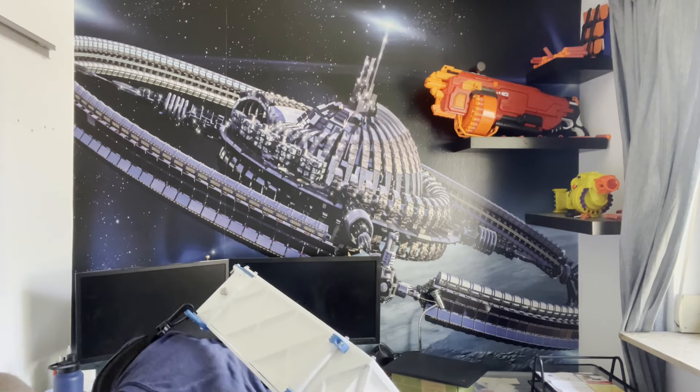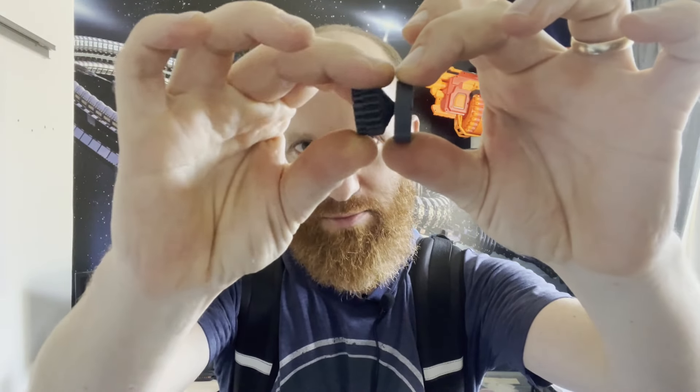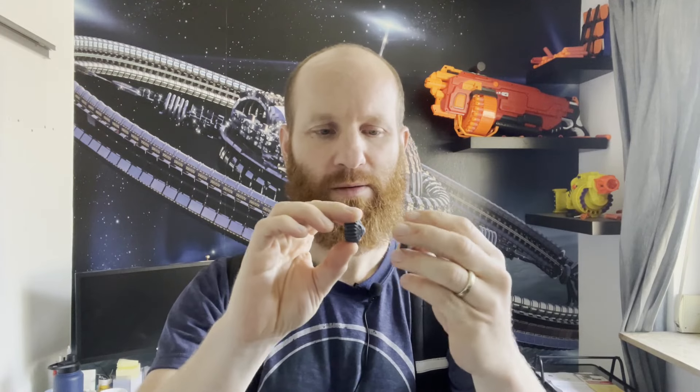This is a bit at the limits of what I've done printing-wise — there are a lot of stresses and forces going on. What I've done is made what's called in German a 'Sollbruchstelle' — like a deliberate weak link. If you have a chain, the weakest link breaks first, so you deliberately make a weak link. You can see it here: this breaks first, so when something goes wrong or forces are too high, this breaks and is easy to replace. It's a lot better than anything else breaking, as happened at Valcom, where you'd have to reprint a lot of stuff.